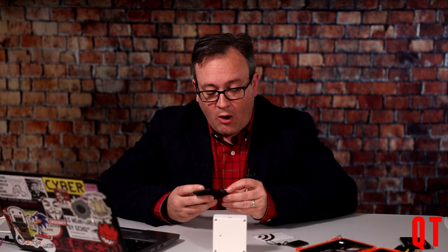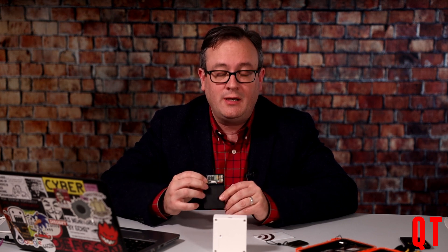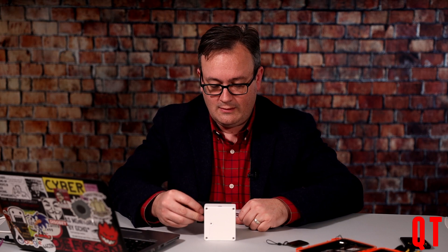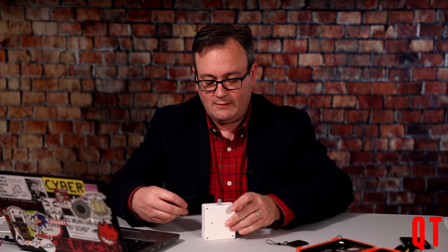On to the main event. For standalone mode you don't need the PC at all — just power on your Proxmark. I have a Blue Shark battery add-on, but if you don't, you'll need a USB power bank. Then press and hold the button to put the Proxmark into standalone mode. You'll notice that LEDs A and D are lit. Simply put the card against the Proxmark like this. As soon as you get a successful activation of the lock, LED C — the third from the left — will be lit, and from then you can open and close the lock as you wish.